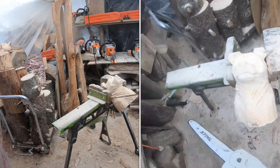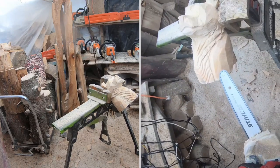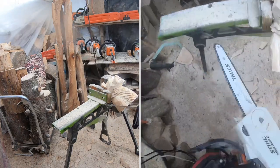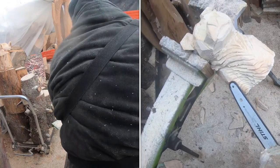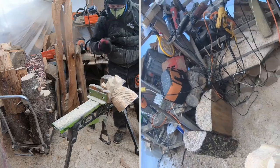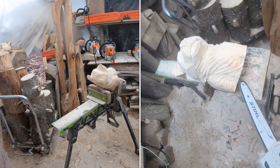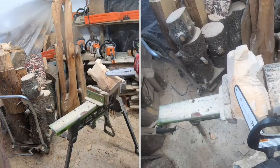We've got him clamped by the neck — not a very big piece. We're laying in the fur so the top overlays the lower; everything is overlapping. If you can make little S-marks it gives a more flowing, realistic look. Continue going over and filling in spots you've missed. These are not straight square cuts — straight square cuts look exactly like that and don't look like fur. Practice your furring; if you haven't done a lot you're going to be burning your forearms, so take breaks.